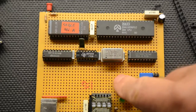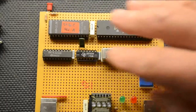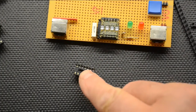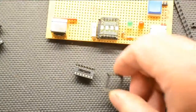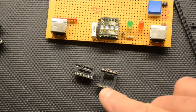We're doing it on Veroboard. The Veroboard has sockets on it and the ICs are in the sockets. People ask what sort of sockets we use - we either use the folded pin ones, which are like these, or we use the turned pin ones, which have turned pins.